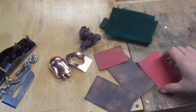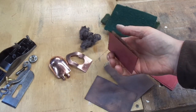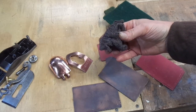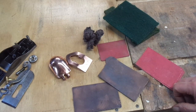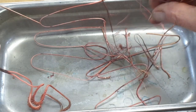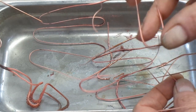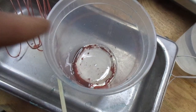These were the abrasives I used. Being a novice, I was paranoid I might sand through the copper plate down to the nickel and possibly beyond, so I used worn pieces of 220, 320, and 600 grit. I also used Scotch-Brite pads and steel wool as a final polish, then brought it over to my drill press where I have a buffing wheel. These here are the anodes — if you look carefully at these wires, they all started out as 14 gauge, and you can see the anode really did sacrifice itself — they got very thin, filament thin in places. Part that was not in the bath shows how thick the wire was originally. A fair amount of copper seemed to end up in the bottom of the container.